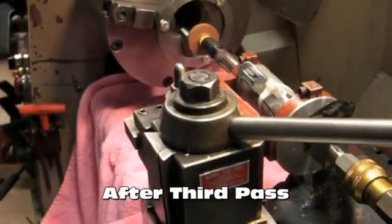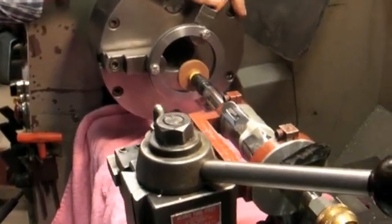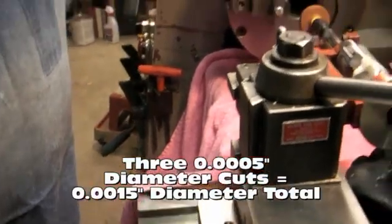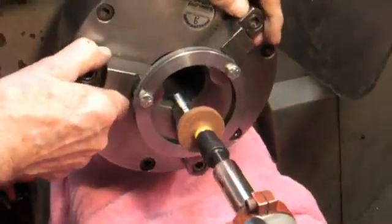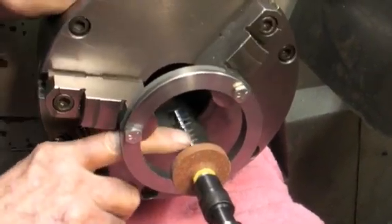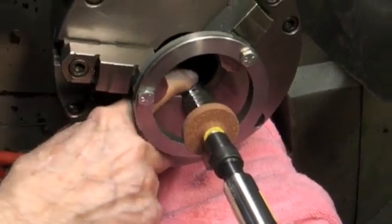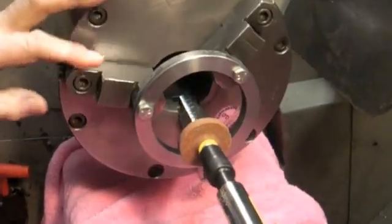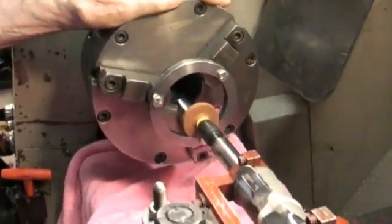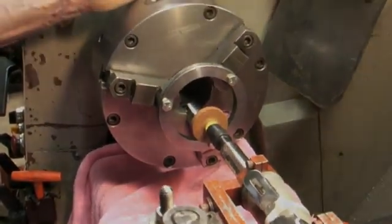After many minutes of slow, painful grinding in about 1.5 thousandths total steps, I finally have that one wayward jaw where I want it. It's got a couple of little damaged places in it that didn't clean up, but otherwise now all the jaws have cleaned up real well. I'm going to make one more pass down and back for a spark out, and we'll see what it does and call it a day.